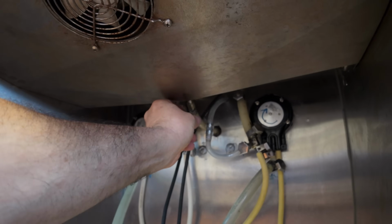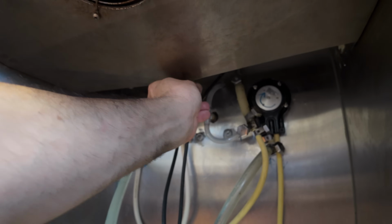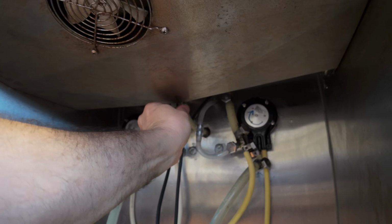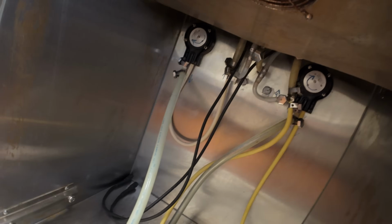And I think what I'm gonna do is pull the charge and weigh it back in for the cabinet. It's only like 8 ounces, 134A. And he said he was having some problems with it freezing up. It was warm. It showed about the average pressure you normally would see, but at 8 ounces, it's almost impossible to tell if it's low or not, and not at temperature. If it was at temperature, it'd be a different story.